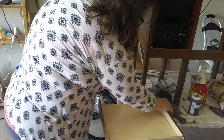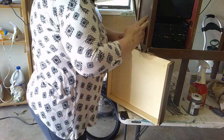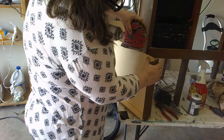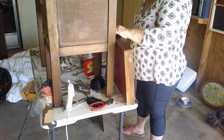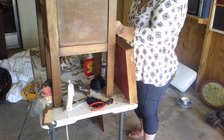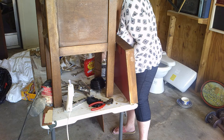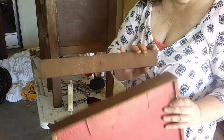I cut a piece of really thin plywood to the same shape as the original drawer front, sanded it smooth, and attached it using Titebond and hot glue, letting it sit for several hours. Titebond is a great wood glue for these types of projects because it will set up in about two hours. I washed away the extra with water — it's a water-soluble glue, which is great. Then I used little teeny tiny penny nails to give it some more durability and sturdiness. There's the old drawer, there's the new drawer.